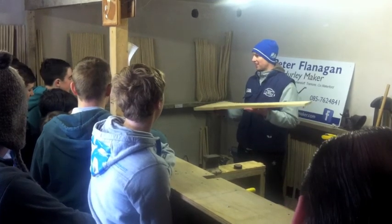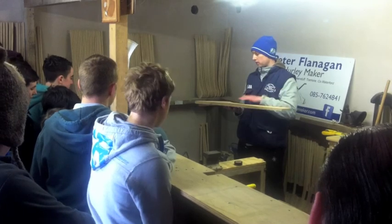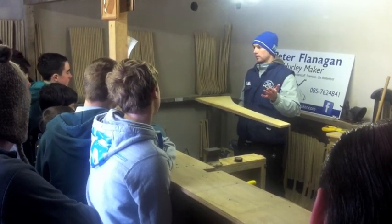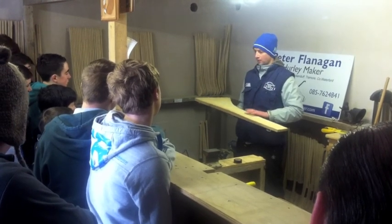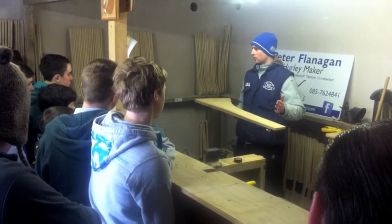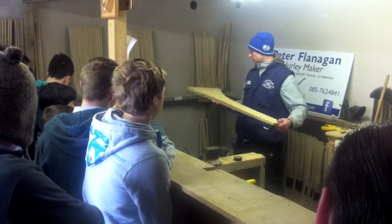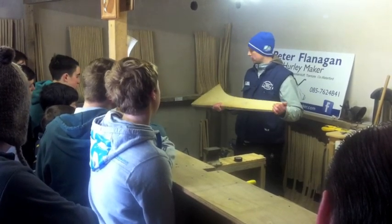Maybe I'm old school, but with kiln drying, like I said, they take the moisture out, okay, and then the hurley could be used within six weeks of being knocked, as compared to the way I do it, where the plank wouldn't be used for at least a year later, you know. So by leaving it to season naturally, you're giving it every chance to season, okay?